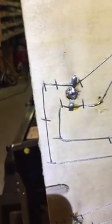heat up the pad. I can't really do this with one hand, but you heat this up with the light bulb in there, the spring pops out, and then you heat it up again with the light bulb in there. Take a flathead screwdriver while you're heating it up, push the spring in, and then pull the heat off and let it cool for 5-10 seconds, and then it should remain in place. Then you can still get the lamp in and out and make good contact. Once you do that, that should pretty much solve any connection issues you have. And then when you turn it on, all of your lights work.